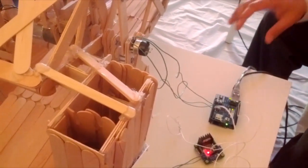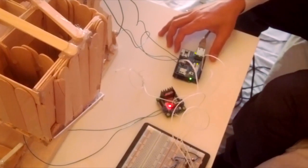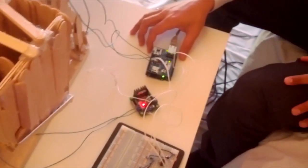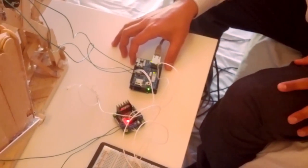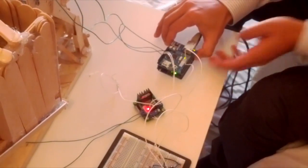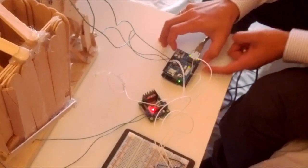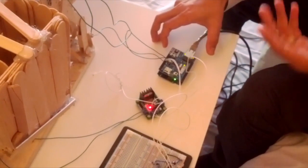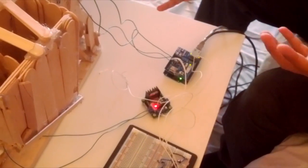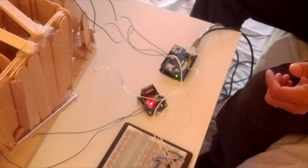The DC motor is controlled by an Arduino board. Now Arduino board is a prototyping board which is open source, and in this case, to control the motor, I connected the Arduino board to another shield called Ethernet shield. I did this so that I can host the controls of the bridge on a web server so that it is accessible by any internet enabled device.